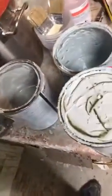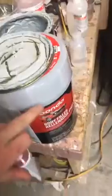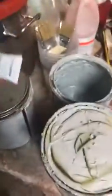Let me cover up the one I don't need here because I have enough in that one to at least do the first chunk and make this video work. You're going to use just a normal cream hardener that comes in this little plastic cap on your Bondo can. This is what activates the Bondo. To activate the resin, you need a bottle of MEKP. It's methyl ethyl ketone peroxide, MEKP, and it's the hardener that activates the resin.